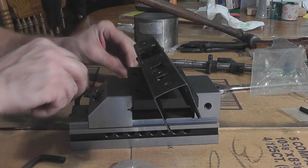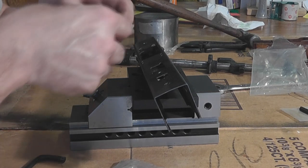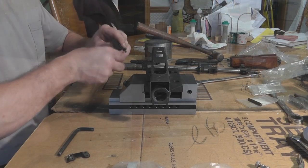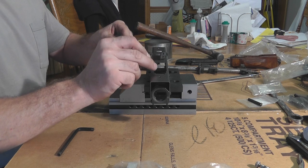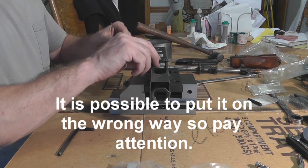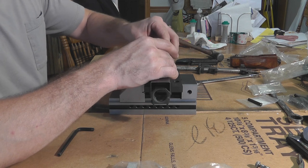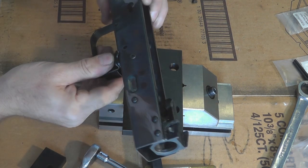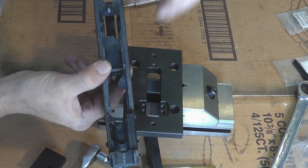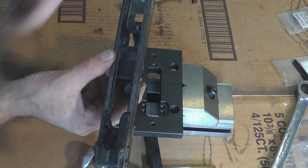The rest of you are going to use your standard number five rivet there. Go ahead and put your rivets in your trigger guard in all the holes. This plate that goes on the bottom of your receiver goes in between the trigger guard and the bottom of the receiver — it only goes on one way. The curved upraised portion you want facing where your selector is going to be. Once all the rivets are in place, there is a steel block you need to slide in just under the center support rivet, and it's going to sit on top of those four rivets and be used to crush them.